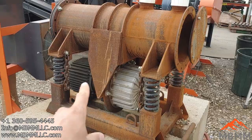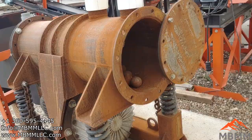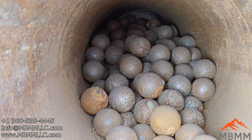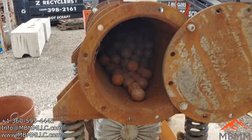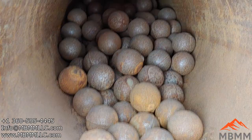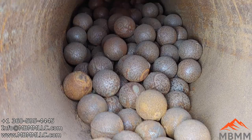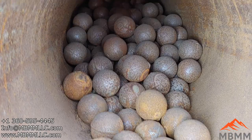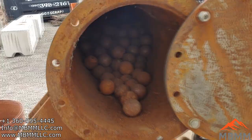Here's this little mini ball mill — and it actually vibrates. This is a huge vibrating motor here, on springs on each corner. On the inside it's full of manganese steel balls. It's a batch mill, so I'm going to add our material in here, close up the lid, and turn it on and let it run. Normally I fill it up about a third with balls, and a lot of the space between the balls gets filled up with muck — about half to two thirds full with material. I'm going to try it dry this time. I'm going to take our two buckets, put them in dry, turn it on for half an hour and see what happens.